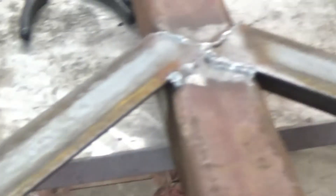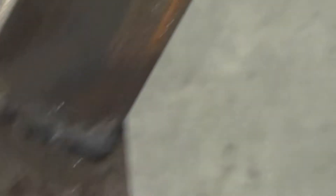Anyway guys, this is what the bottom side there is looking like — the braces that are running up. I set them right, I cut them 24 inches, square cut them, just laid them in there and welded them on the outside, the ends, and on the butt in there. And on the top, across the upper upright, and then where the two meet together I'll sew all that together. But that's where it's going to be.